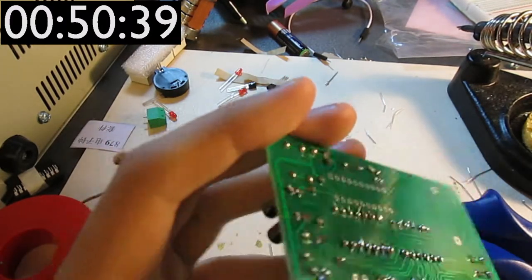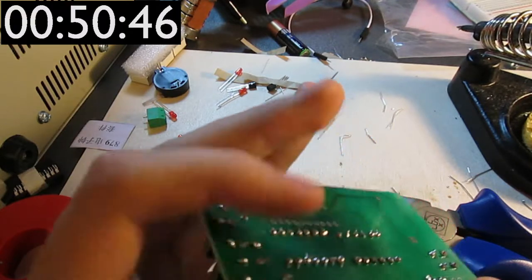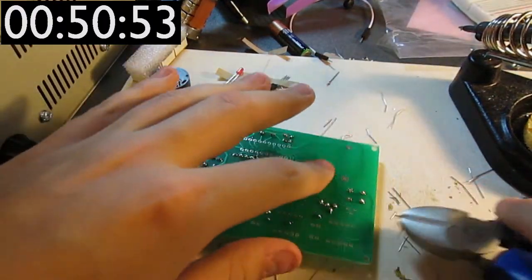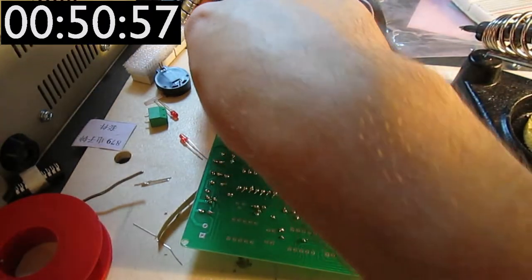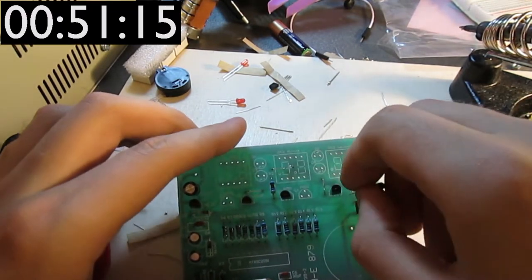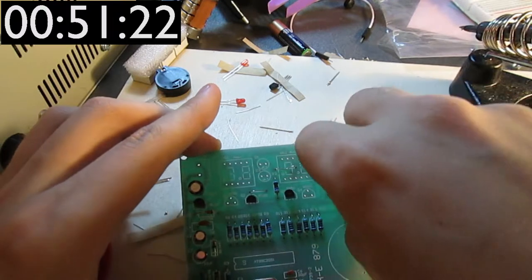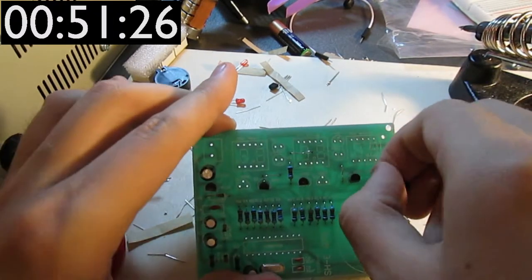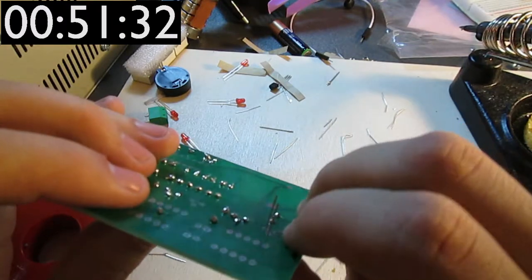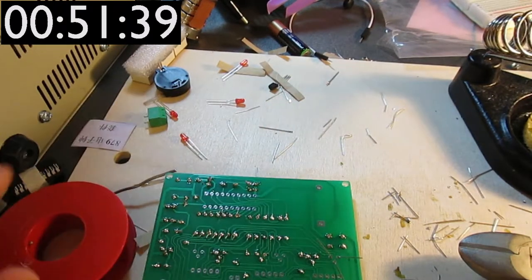Actually, I think it is important, because it goes to the LCDs, so we'll see if the LCD behaves weirdly. That'll be the reason why. I mean, not LCD, LED segment display, because soldering LCDs to the board would be much less simple to do, because if I recall correctly, LCDs are slightly temperature dependent as well, which is why you don't usually get kits with LCDs to be soldered on them.